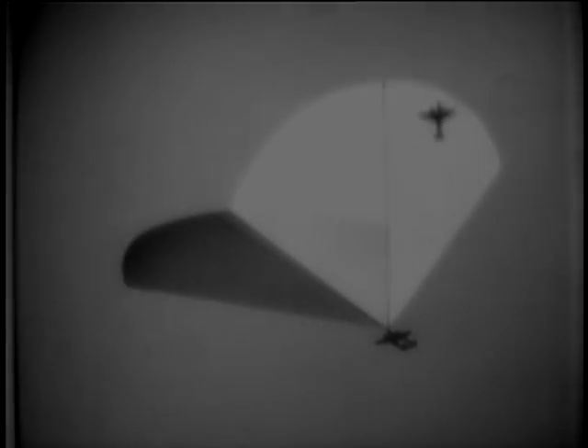A bomber that's ahead and to the right of the night fighter will appear up and to the right on the scope. Since this B scope is intensity modulated, like the PPI you saw a while ago, the target appears as a glowing blob of light. However, the scope presentation isn't fan shaped like the sector the beam scans, or like it would appear on the circular PPI. If it were, the short range echoes would crowd together and be hard to spot. So for ease of operation, electrical circuits actually stretch the picture into a rectangle. This is the presentation furnished by the airborne B scope.